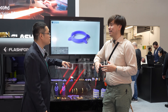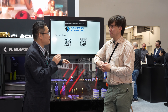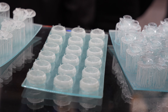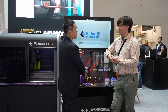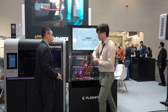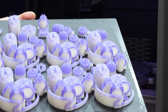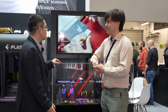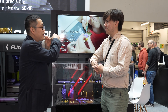What makes wax better than a resin-based investment casting process? First, if you use resin you have a lot of supports. Removing supports manually for one piece is acceptable, but our goal is massive production — you cannot do that for 1,000 pieces. We have a record of producing 1,100 rings on one build plate in about 10 hours. Then you cut everything from the tree manually.